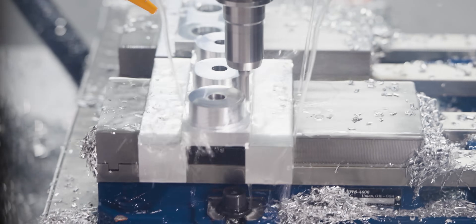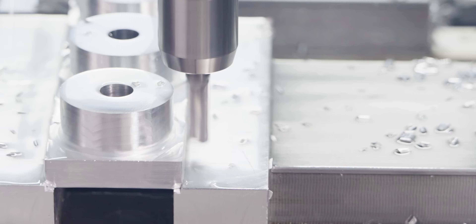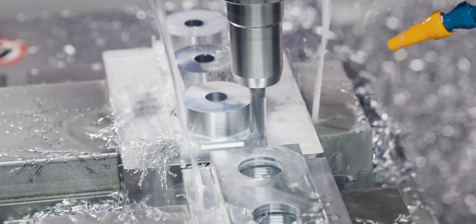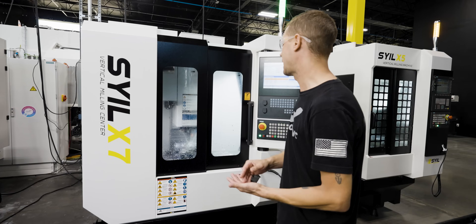The tool is going to full slot down around the bottom of the part but stay off the walls. This is so that the chamfer can get done on the back side of the hex on op 1, so that when we flip it over on op 2 and complete the hex, we'll have a fully finished part. After it finishes the outside and roughs the hex, it's going to ramp down the inside of the part to again remove the majority of the material.